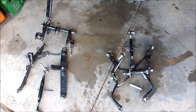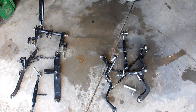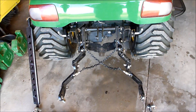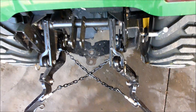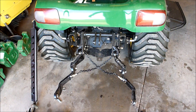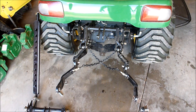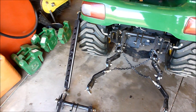I'm running out of time on my SD card, so I'll go ahead and wrap this up. That's the difference between the hitches. I really like the Category 1 Limited strictly because it can come on and off. Got the hitch mounted — it took me exactly a minute and 45 seconds, and that includes turning the tractor on so I could lower the three-point so these arms could line up. Because I haven't used the three-point in quite a while, it was just stuck up in the up position. It just does not take very long to put this on. You can see it's 26 inches between there and there — at least that's a 26-inch Category 1 bar.